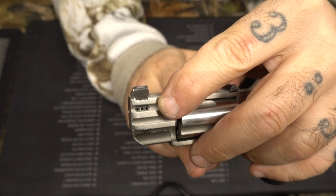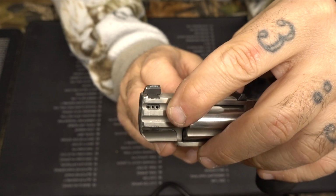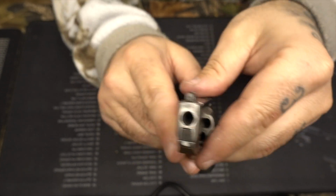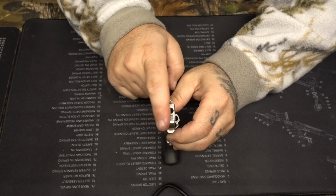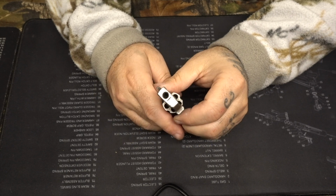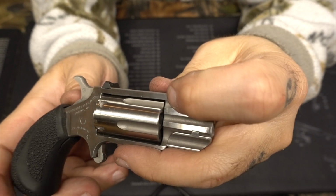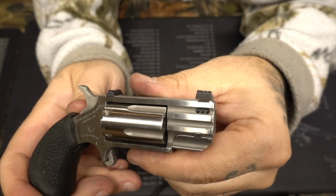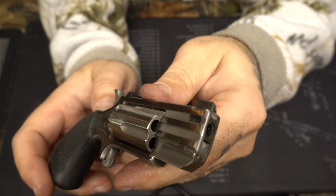So rather than ship it back to them, I'm going to drive this out myself and just file it, and I'll take care of that in the process of dehorning this whole little revolver. Next step is I'm going to lock this in a vise and just take emery cloth and go back and forth and get it nice and smooth. Then when things are all said and done on this whole dehorning job, all these straight lines, these polished flat lines, will all be polished with flits. It'll all match nice. I think it's going to turn out nice when it's done.